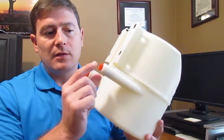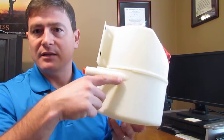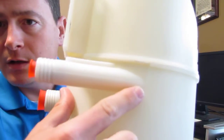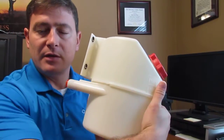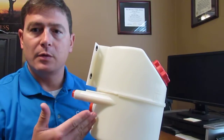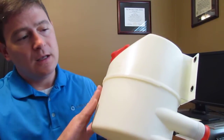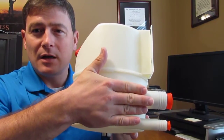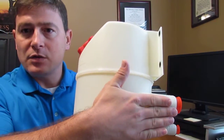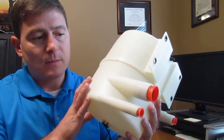What you'll notice is there's one return port, and that return port is connected tangentially to the cylinder here. So what happens is as fluid returns to the reservoir it's accelerated around the cylinder, and that tends to force air bubbles to the center where they're naturally dissipated. Another advantage is that as that fluid is pushed around the exterior it's naturally forced back into the suction area, so you get a natural charging effect, making it a lot less likely that you'll be dealing with cavitation.